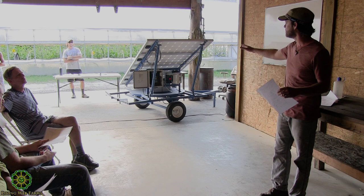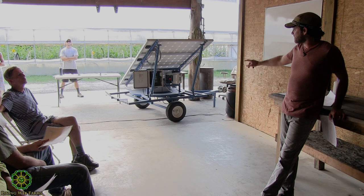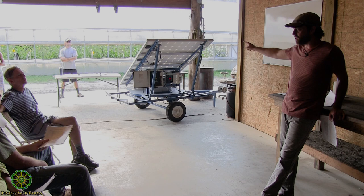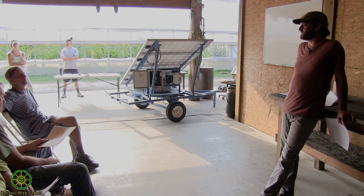Some of the challenges: on a massive scale, the main reason solar and wind aren't more prevalent is cost, but also because there's no great way to store energy at utility scale — that's a really tough problem. A way I like to think about it: instead of thinking about running your load directly off the panel, think about running it off the battery, and the panel is just the charger for the battery. If you plug a panel directly into a load, you're dealing with extreme variables — when shade comes your motor dies down, when it gets really sunny it ramps up, and motors don't like that.